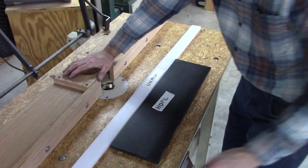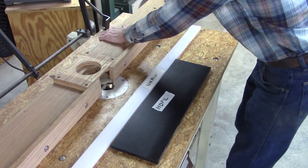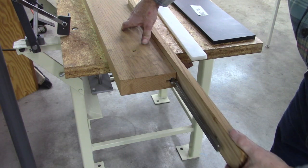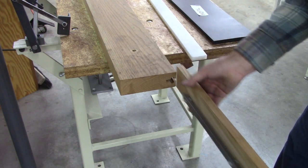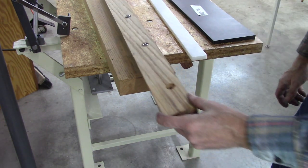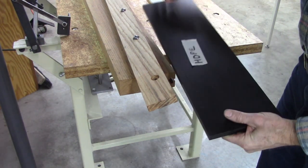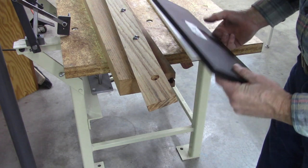This fence here, you'll notice I've got an adjustable, the old fence. The gap around the bed is adjustable. Here's what I did with the old fence, and I think it was overkill. I did it for wood. Wood moves and contracts and bows and everything with moisture. And plastic's a whole lot more stable. And I think this will do good with just 2-inch slots in it and screws from the front.